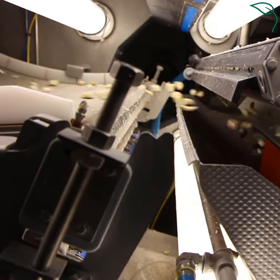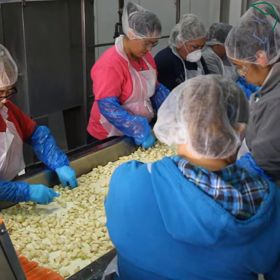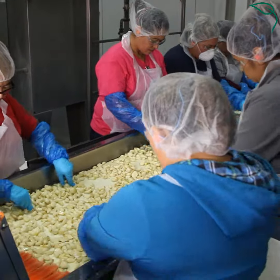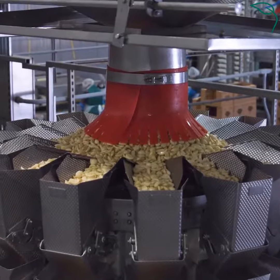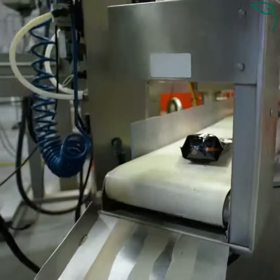After that's our second optical sorter. This optical sorter is going to be analyzing every clove of garlic for any kind of defects or decay. If it detects it, it's going to fire a stream there and get it out of the line. There's a final quality control check after that with a small crew, and it's finally run into our automated bag filler, which is capable of processing one pound, three pound, or five pound bags for retail and food service.